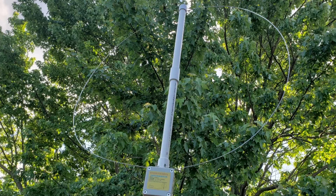The breakthrough is happening in the little amplifier box you see at the bottom of the picture here. That's very different from a radio overloading. I can't put a filter on the cable from the antenna to the radio because it doesn't change anything — the breakthrough is already happening in that little amplifier box.